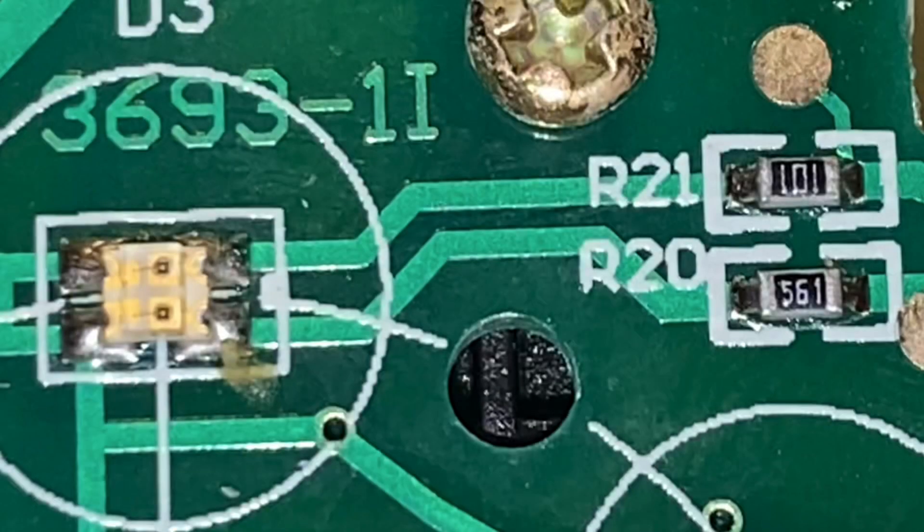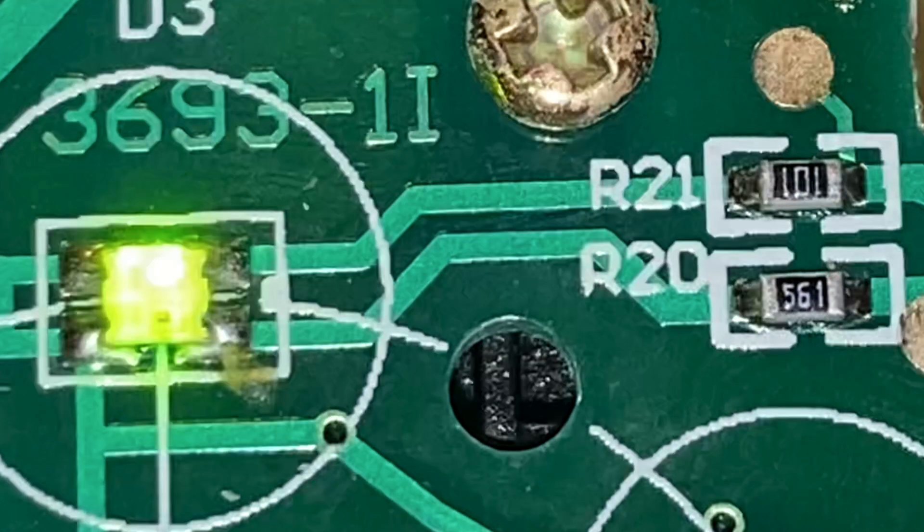On the 2005 original iDog, with the exception of the bottom LED, all of the outer LEDs have their positive end on the left and negative end on the right, with the red on the bottom and green on the top. The bottom LED is inverted — the red is on the top and the green is on the bottom, with the positive end on the right and the negative end on the left.